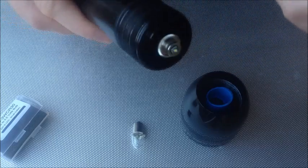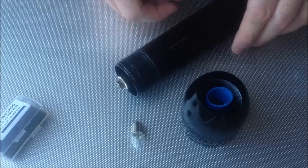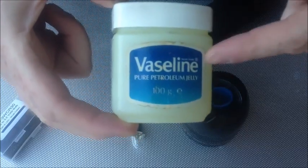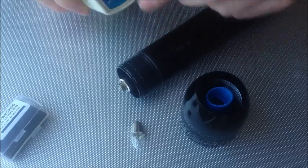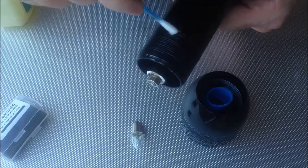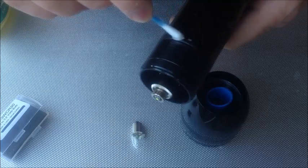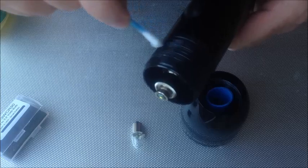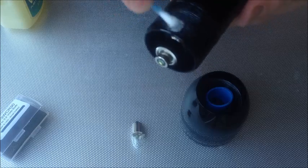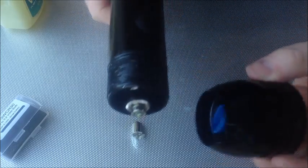Nip it up — yeah, that's in there now. Just before I put this head back on, a good idea is to use a little bit of Vaseline on the threads and also on the O-ring seals. Get a little bit of the Vaseline and just apply it — you don't need too much, just a smear. That should prolong the life of the O-ring, and also put a little bit on the threads so as we screw the head back on that will distribute the Vaseline over the thread.